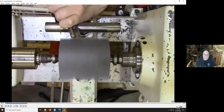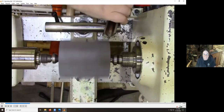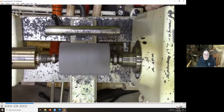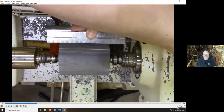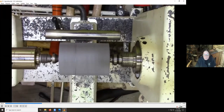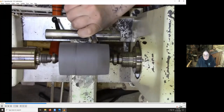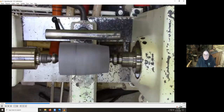Back to just bringing the blank to a cylinder to know what I have to work with for the size of spaceship. There's nothing magic here — I'm using a spindle roughing gouge. One thing with having the veneer in the middle: sometimes you'll get tear-out at the very edges of the blank, but you can turn that away. Right now I'm marking the area of largest diameter for the spaceship and I leave about an eighth to a quarter inch area that I'll smooth down later, but I don't want to go inside that pencil line right now.